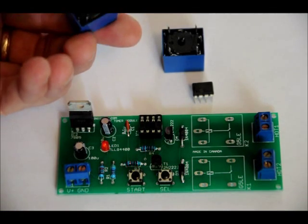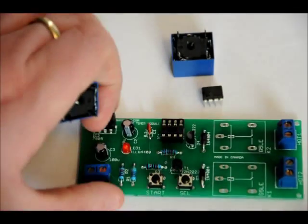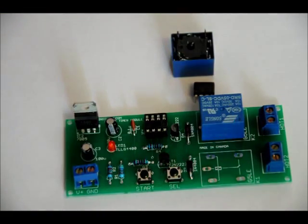Your relays have three pins on one side and two on the other, and they go into the K1 and K2 slots. They really only fit in one way — they pop right in. Make sure you have a healthy dose of solder on each one that flows nicely. One thing to mention about the socket: make sure there are no shorts — the pins are close beside each other, so take care in soldering.